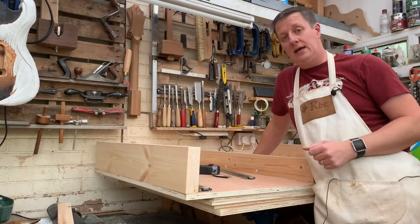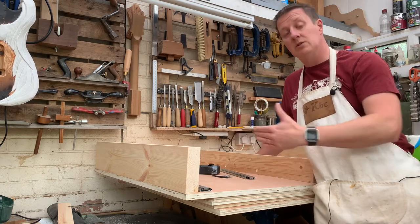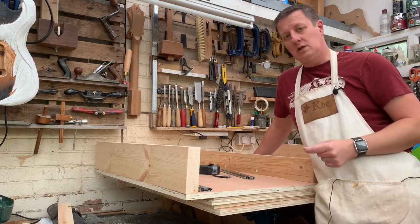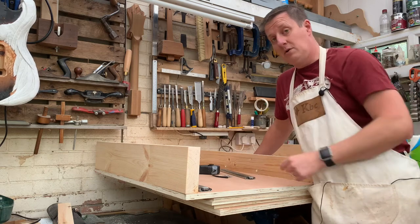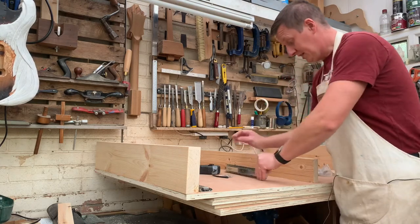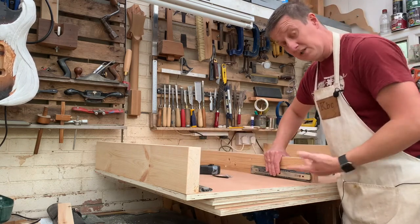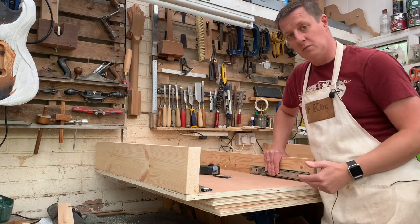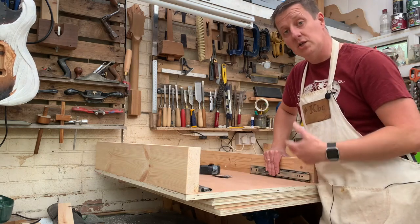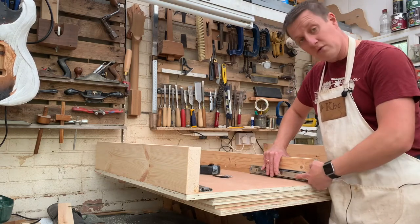This is where I'm going to differ slightly from the plans. After screwing these on, we're supposed to take our 21 inch wide sheets to make the drawers up. The trouble is it's only going to be 21 inches exactly if your timber is exactly the same size as in the description — and on this instance it isn't. By the time we attach the runners to each side and account for different thicknesses of wood and different companies' versions of the runners, we end up with a slightly different width. So I would always put these in place first, then measure to cut the gap that you actually have so they fit and screw nicely.